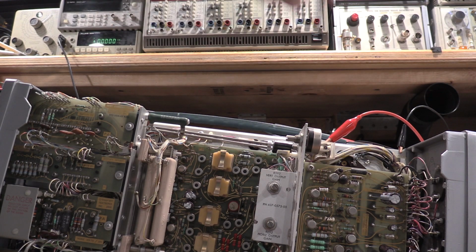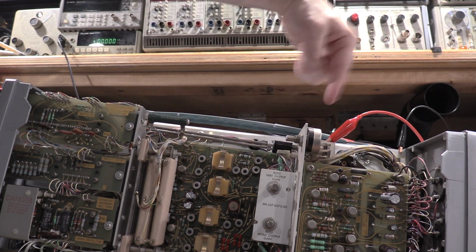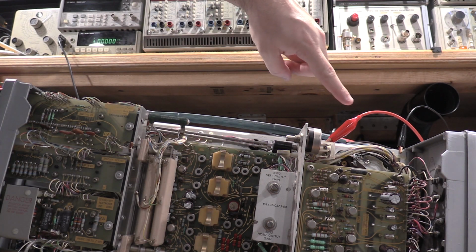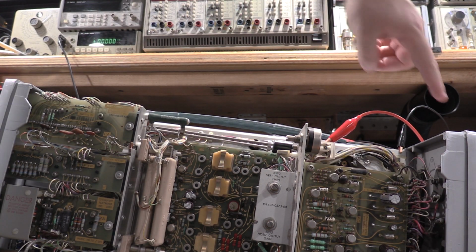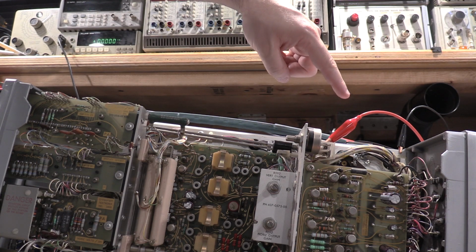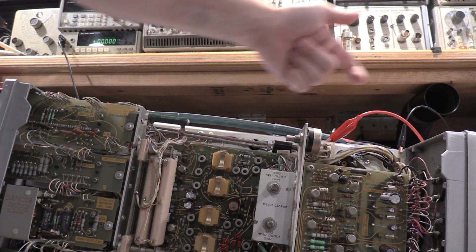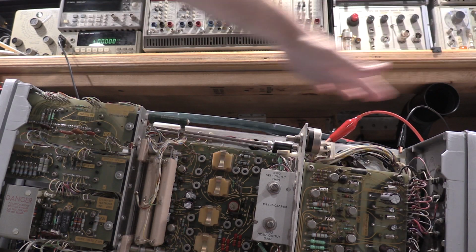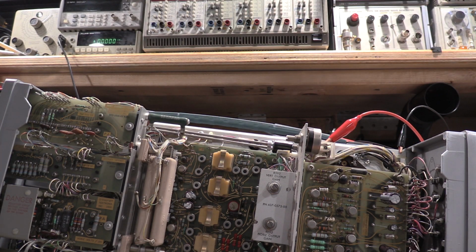The Fluke high voltage probe is up there. There's an alligator clip that just runs off the end. Just note these alligator clips, and this is silicone meter lead wire. It's not rated for 4 kV, so you could get zapped just off the insulation on this wire. So I'm nowhere near this test setup while it's running. And the unit was off when I hooked it up. I'll turn it on, take the measurement, turn it off, unhook everything, and then continue.